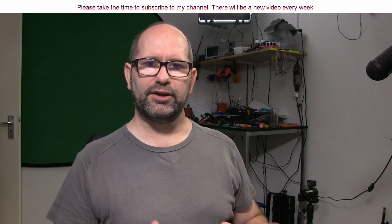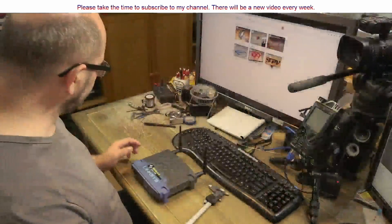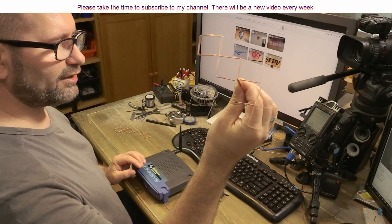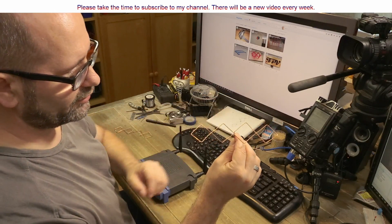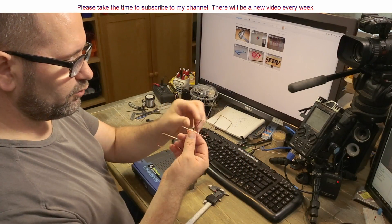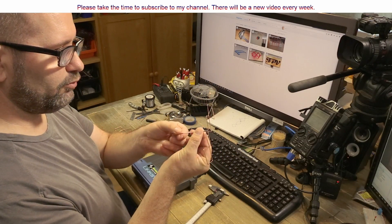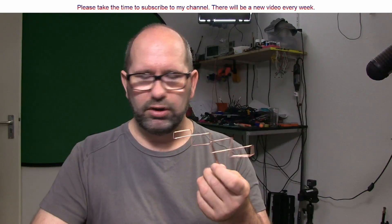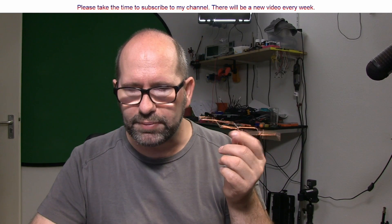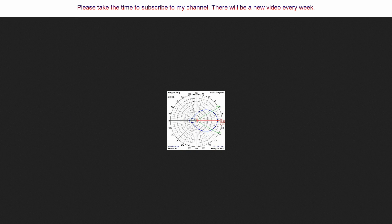What I did was I created an antenna. I started out building things like this — this is called a bi-quad antenna. This is actually a double bi-quad antenna. What this does is give you reception which is directional. I can point it at my modem and my wireless access point and make sure I have reception from that side. Here you can see that the reception is just to the front of this antenna — it doesn't receive from the back side very well, but it works very well on the front. And WiFi is also transmitting of course.